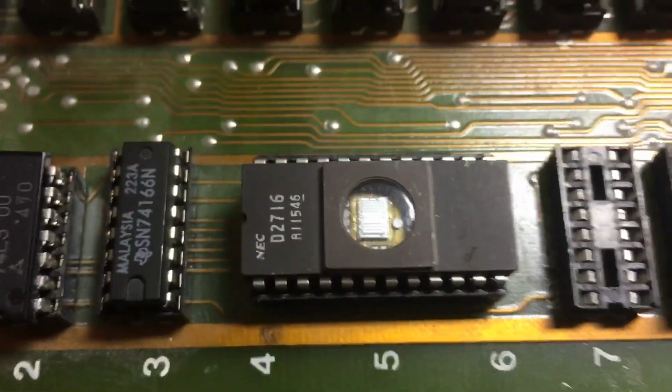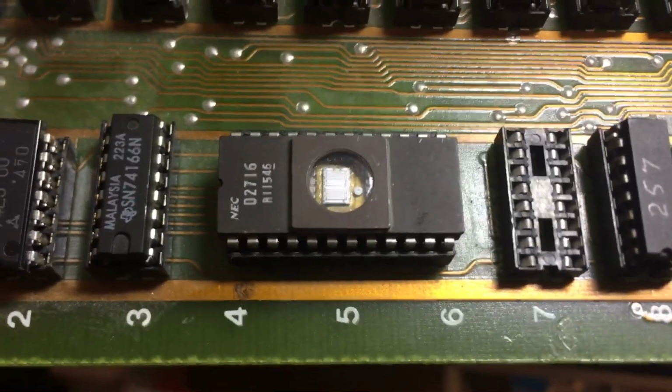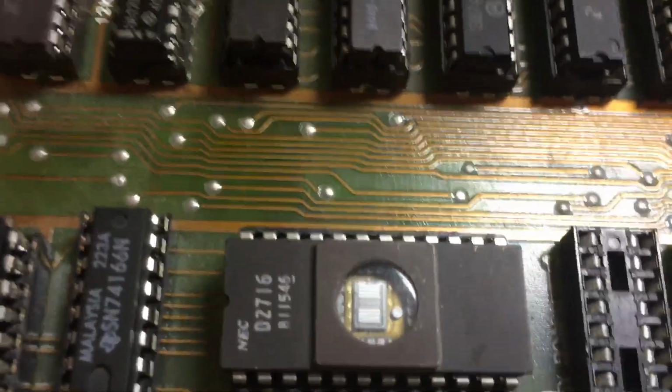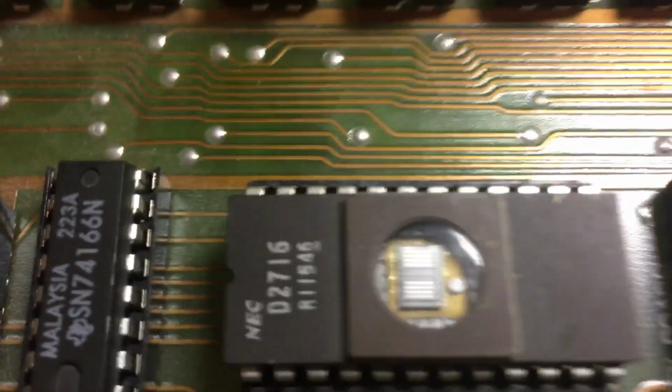And I understand why, because whoever soldered the socket on this motherboard soldered it backwards so as to fool you into plugging it in backwards. When I examined that, I said, oh boy, I've seen these EEPROMs, these 2716s, when you plug them in backwards, the die right there looks like a light bulb. It turns into a light bulb and just flashes. It's like a lamp. So I knew that was toast.